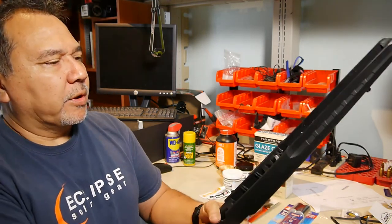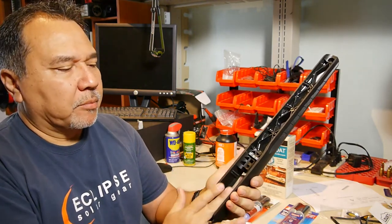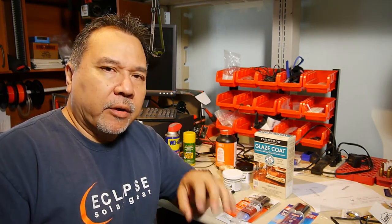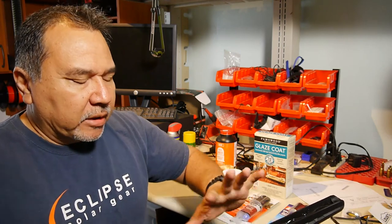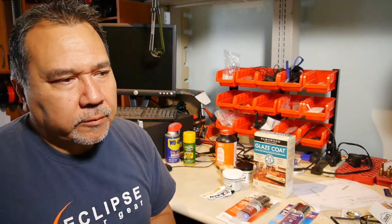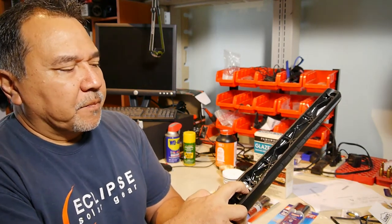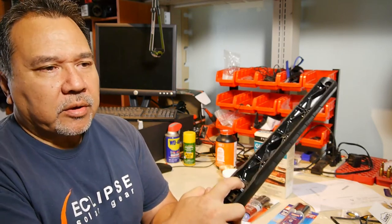Well, that's not what you're doing with the rifle stock. Sure, you want it to adhere to your stock, but you have releasing agent on the rifle and all the metal parts so that it won't stick. So when you put everything together, it's under compression. You're bedding the stock so it'll be a good uniform fit, and the shear strength is really nothing to do with it — unless you're looking around the recoil lug. You're filling in gaps so the recoil lug will fit specifically in the slot, and when it's recoiling back, it's still under compression. You're still not trying to hold anything together.